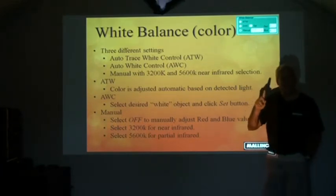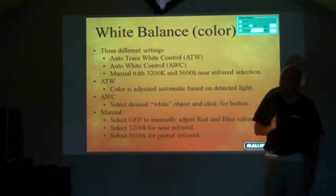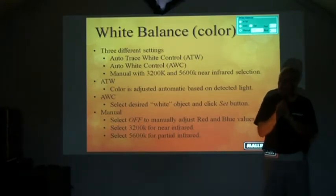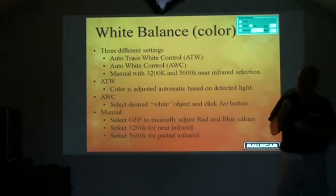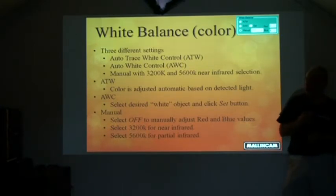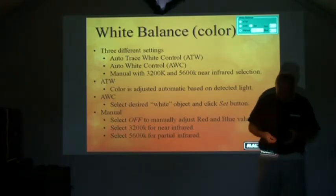Right, but it's not the same as a true black and white imager, because a color imaging chip has to handle all three colors in a pixel, and a black and white imaging chip doesn't. So you're kind of cutting your resolution down by a third on the color one, because you've got to handle three colors. Whereas the black and white imager only has to handle that it's either white or black, or a shade of it.